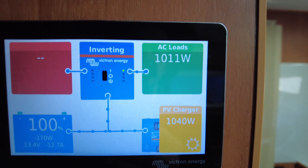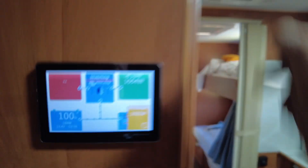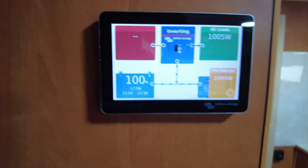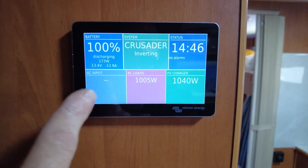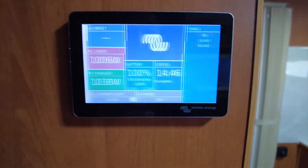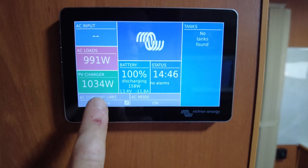There's your loads. These clunkers pull a lot of power. If this had been a Harrier Plus or IBIS 4, that'd be down to about 700–750W ramped up, maybe 850W flat out. This one will go up to 1,100 watts. This AC input screen will light up when old mate plugs into mains power or uses a generator. The AC current limit: if you're on a 10A supply, drop it back to 10. This is only relevant when plugged into a generator or mains at a caravan park — so at a station stay with no 15A input, set it to 10 to avoid tripping circuit breakers.